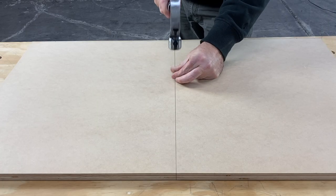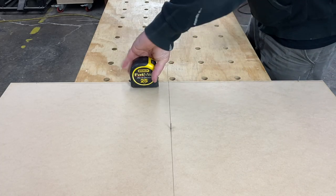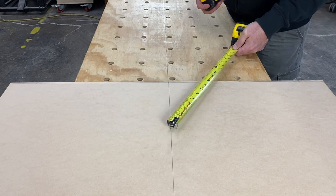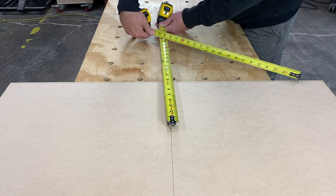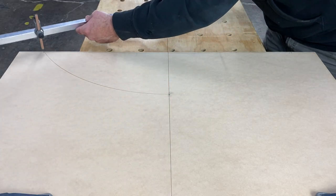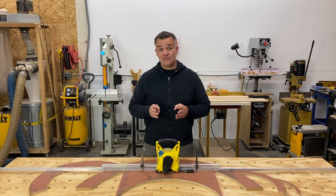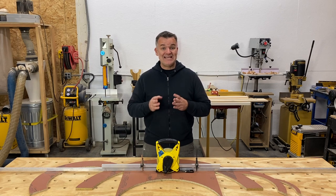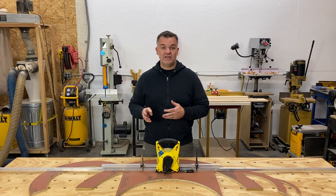In this method you don't need to draw the diagonal lines. Start by placing two nails — one at the top and one at the corner of the base, either side is fine. Then using two tape measures, hook the tape on the nails. When the same measurement lines up on both tapes and the reference line, that is the radius. From here you can use a compass to draw the arch. But like the first example, you're doing several steps, each of which can add potential inaccuracies while spending more time doing it.